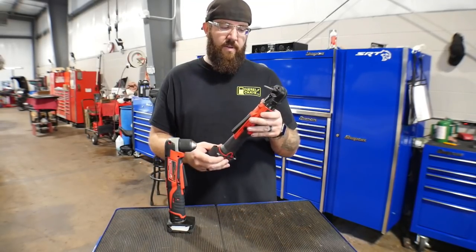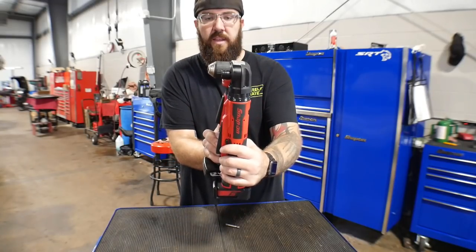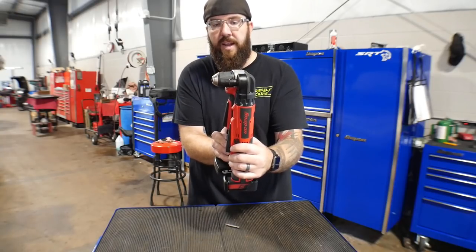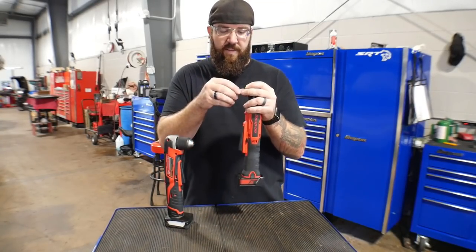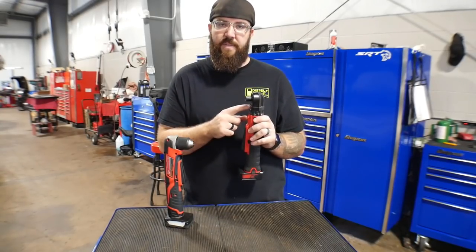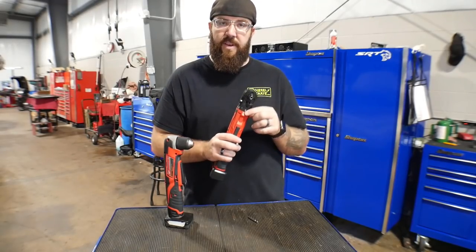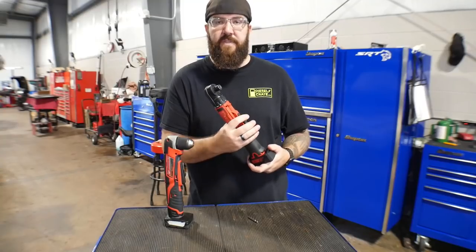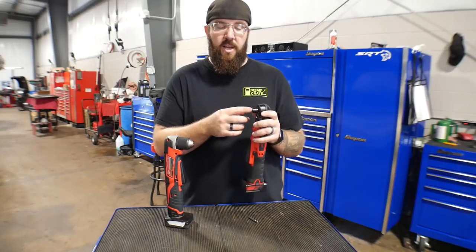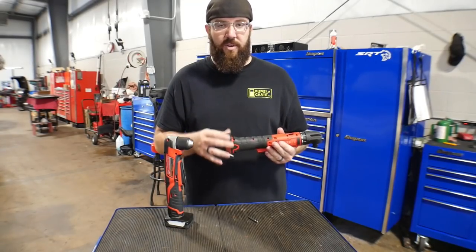Then the Snap-on one right here — the new 761 — we'll give a check of the difference in head. There's about an inch shorter length on the Snap-on, and when we're talking about a 90-degree angle for one of these drills, that really does help in tight spots. It does have a nice easy chuck. This Snap-on version has a chuck as well; I'm just reviewing this one because it's the one I got, and it came out most recently. It does have an LED light on the front. The RPMs on this one are quite a bit higher — right around 1550 RPMs. The RPMs are a lot higher, especially if you're going to use the chucked drill bits. I'm a huge fan of the 14.4-volt line, as you guys probably already know.